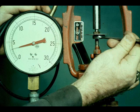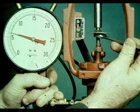We will check this valve first. It is a 3 to 15 psi air to open valve. Apply 3 psi. Make sure the plug is just touching the seat by loosening and turning the plug stem. Apply greater than 3 psi, then screw the plug stem into the actuator stem two more revolutions. The extra two turns will ensure that the valve seats solidly.